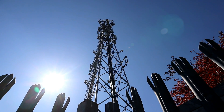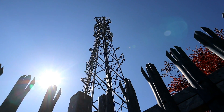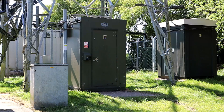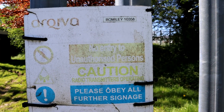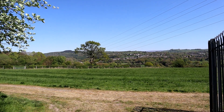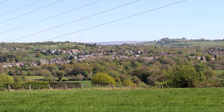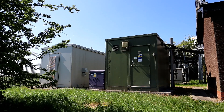Romilly was originally an independent broadcasting authority landlord site which entered service on the 17th of November 1978. Channel 4 was added in May 1985, and Imagine FM was transmitted from Romilly from 1990 to September of 2010, when it was moved to Ratcliffe Towers. The circular polarised antennas for Imagine FM still seem to be on the tower, and now the site is a television relay of Winterhill, also home to some police dipoles as well as mobile phone transmitters.